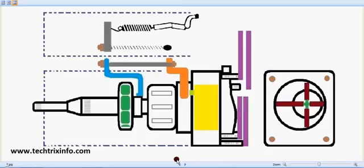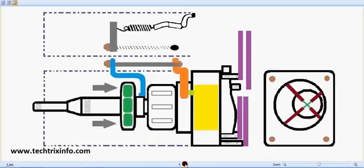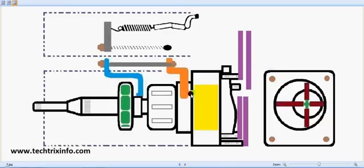As the metering valve moves like this, that gallery is controlled by the demand of the RPM. So that's one thing that's controlling the demand of the fuel flow towards the injectors. And also, when the driver controls the accelerator pedal, the cable connected towards this throttle valve also moves. So when this throttle connection, which is connected towards the accelerator pedal, moves, it actually moves the metering valve because it is directly linked towards this governor arm. Just have a look at that. You can see clearly over here, when this throttle lever moves, the governor arm moves, and resultingly the metering valve also moves. That metering valve movement controls the fuel supply or the gallery, and only that much amount of fuel will be supplied towards the fuel injector line.